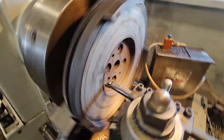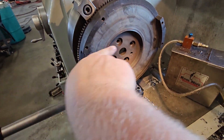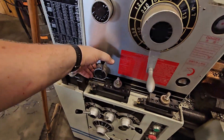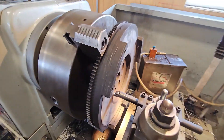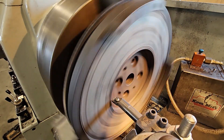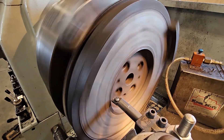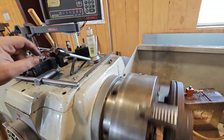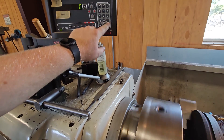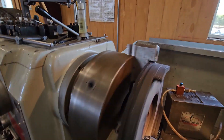Something different here — I want my feed to work its way out. Normally on a lathe your power feed goes in, so I'm going to switch that. Easy enough. I'm going to select tool number 6 and zero it out.